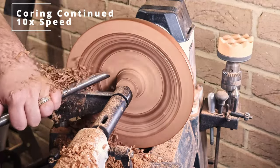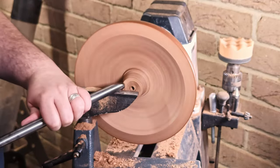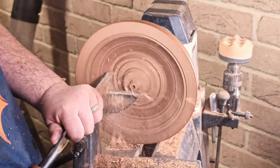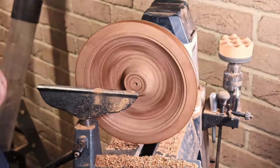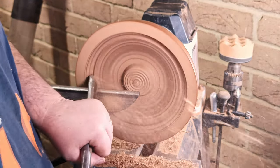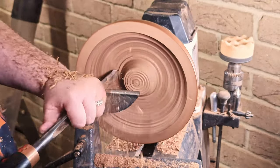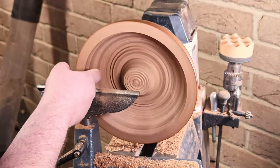Now we're going to go into high speed mode and let's get this done. Right there I've taken the tail stock off completely — I also went and had lunch and came back out. I just dropped the tool rest a little bit because I wasn't able to get rid of that center. Now that I've got the tail stock out of the way I'm able to swing the tool way over to the right and get it in a lot straighter. The problem with having a small lathe is that I do have to take the tail stock off completely — I may at some stage look at getting the bed extension just so I don't have to do that.